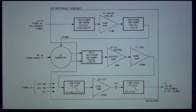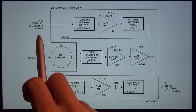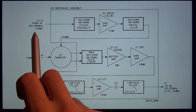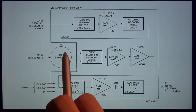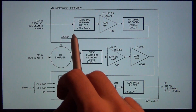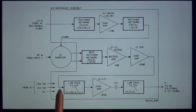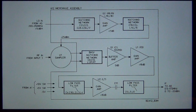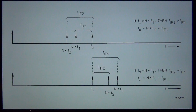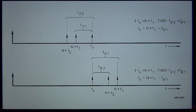Here's a more generic block diagram of it. The LO comes in at very high amplitude — and you can see its frequency range written on it — with sufficient power to really drive the step recovery diode hard to generate those harmonics at high amplitude. 25 dBm of power is used to drive the step recovery diode, which is huge. Out of that comes the IF, through gain stages and a low-pass filter, which ensures you're only looking at low IF frequencies. The IF is then at low enough frequencies for the counter to measure. I hope you followed some of what I said. Once you understand it, it'll be worth it — because the gift of understanding is the greatest part of this scientific work.